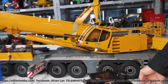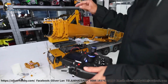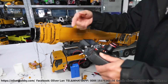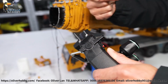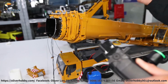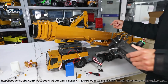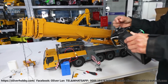Let's check if it is correct. So now the number 5 point is saved, but you are not sure of the procedure for unlocking the pin for the boom to be secured with the cylinder pin. So the best way is only doing like this. To finish the procedure, you must push backward to withdraw back the boom. Withdraw back. Yeah, it's not starting, which means it already finished the procedure, but do not push forward. If you push forward, the cylinder pin may not be locked. Again, it's sliding out without the claw unlocking the top boom pin. So now it's finished, it's okay.